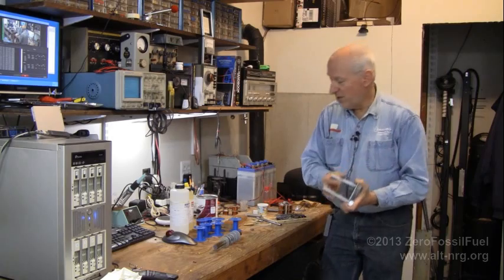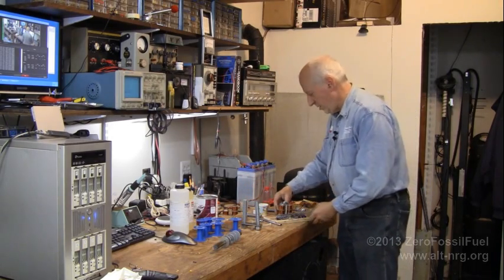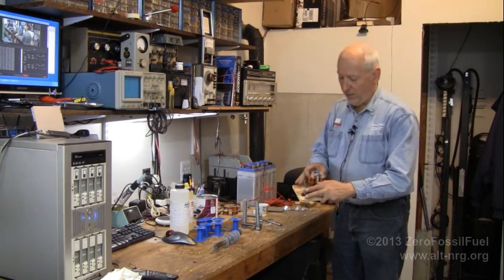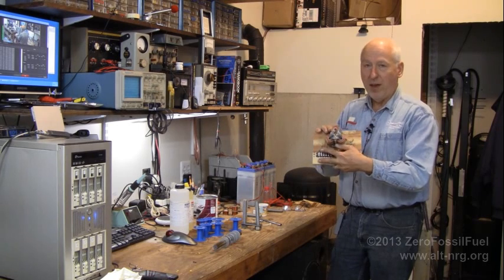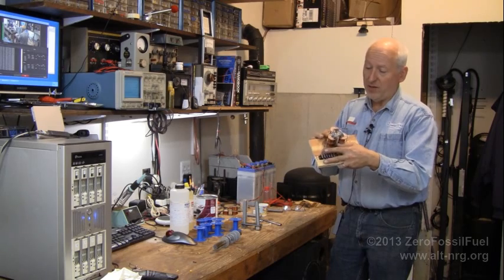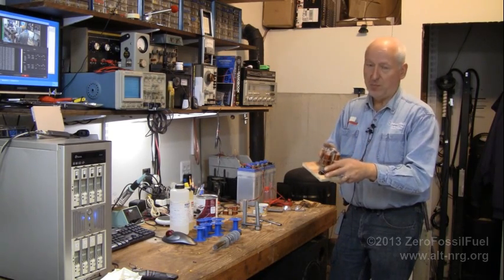I don't think that's what I'm looking for, and that was the reason why I went with the stranded wire that I wrapped in my original transformer. But the problem with this arrangement is that once the cores are wound and once you've threaded the steel wire through the cores, you have no way of changing the orientation of your coils or really experimenting.